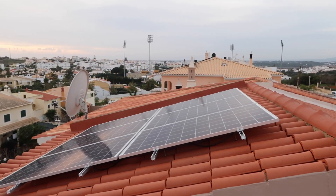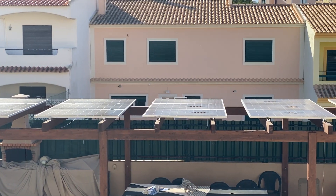One thing to keep in mind if you're wondering about putting solar panels on your house is that nothing is static. We are in December 2021 and I will try to do these tests again towards January/February and then towards summer, because my feeling is the results will be a little different. In my particular case, I've got six panels on a roof at 15 degrees inclination towards south, and 15 panels on a pergola in the backyard at zero degrees inclination. During summer I get more production, but during winter I get less than I would with a bigger inclination.